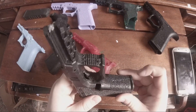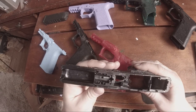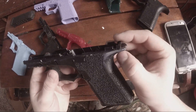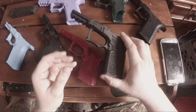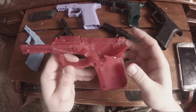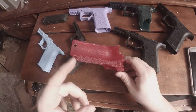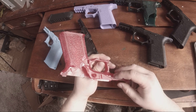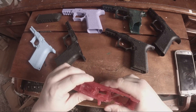Bubbles inside the mold itself cause problems - you have to file that off, cut it off. There are holes you have to drill back in because the mold itself didn't capture the hole. I probably didn't do the mold right; I have to go back and do probably a two-stage mold instead of just cutting it out. This was a lower quality polymer that I didn't pour right - it dries really fast, it's like a two-minute thing. I pour it in and it takes a while to fill all the way up, and then you get bubbles everywhere. This stuff didn't come out really good.